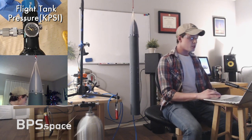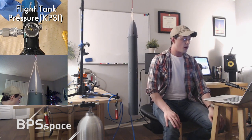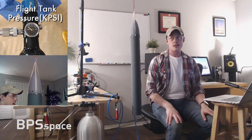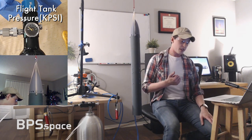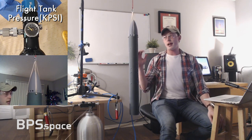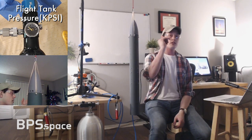So Moonman22 asks, that's just PI. Actually, there's no I term in this. Right now it is a straight bang-bang controller, which means it's just the P gain. If you're curious, I think the P gain for that was 0.06, like a KP of 0.06, and it's directly referencing the z-axis orientation.